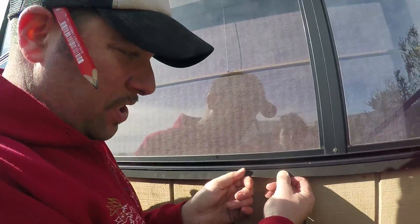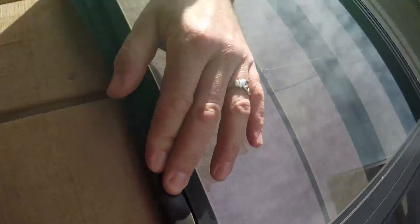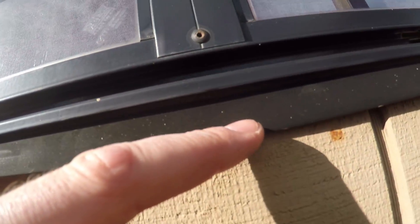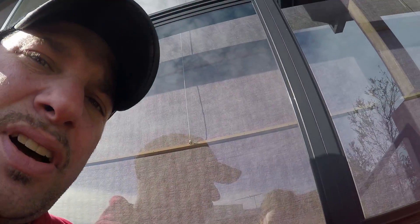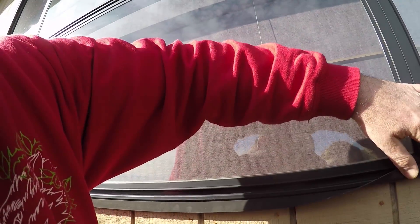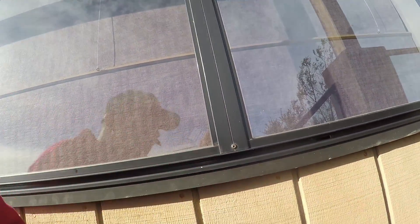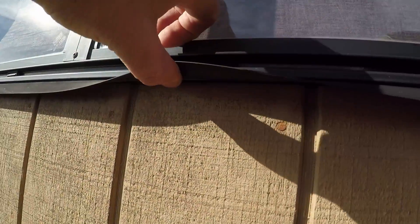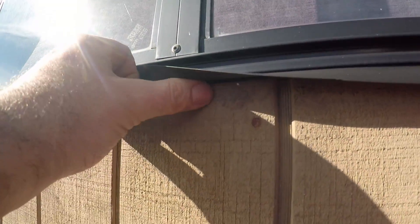Here what we've got is a rubber flashing under the windows. If you look on the underside, it's still really quite healthy. But if you look at the top side, it's showing signs of ageing and deterioration already. What ends up happening is in a very short period of time — again, it's facing the northwest, so the hottest part of the day — that'll deteriorate really quickly. That'll disappear and it'll allow the water and the heat to hit here and deteriorate this cladding system much quicker. That's why we need to make sure that this is painted and has got a secondary seal behind it. Being this close to the ocean, it needs to have a secondary seal.